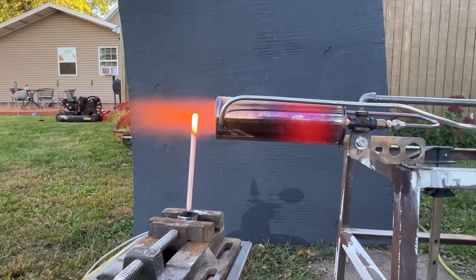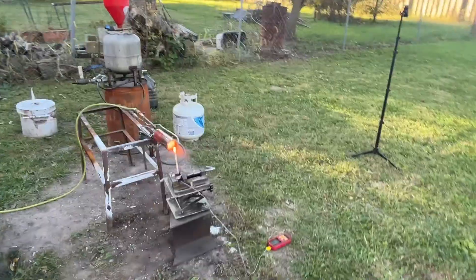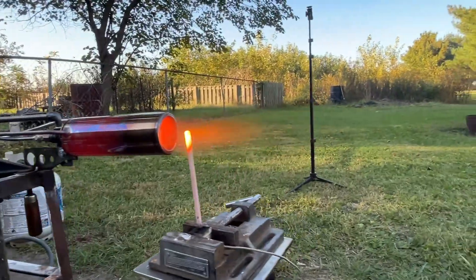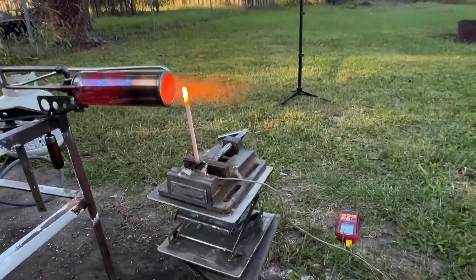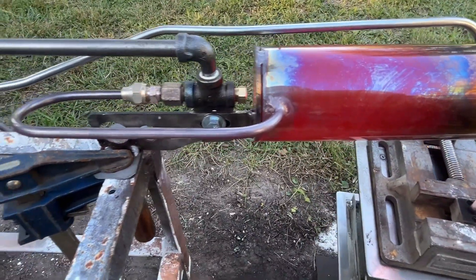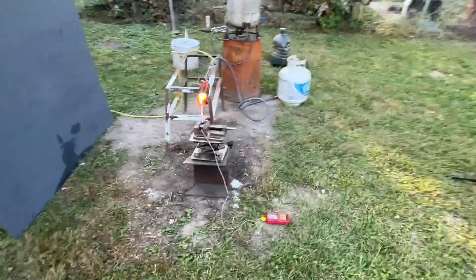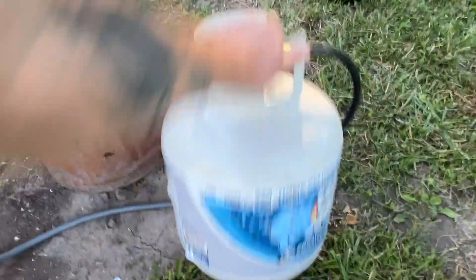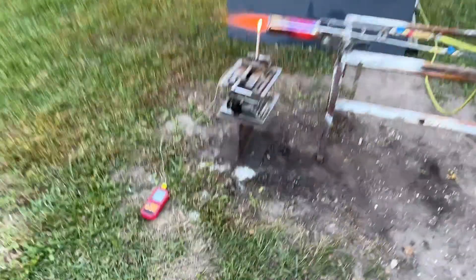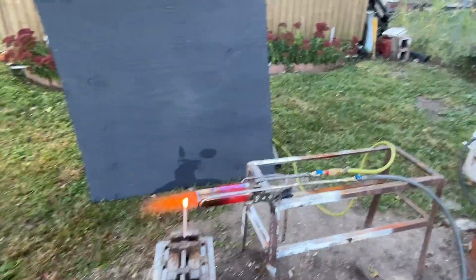I feel like with the right setup, this foundry burner could get a furnace up to 3,000 degrees Fahrenheit without oxygen. I feel like we could melt the higher-temp steels and metals — titanium, all that — with this thing set up right. We're going to have to go with liquid propane though; the bottle just ain't going to do it. We're losing pressure and temperature as we lose bottle pressure, but we're still above the old personal record, which is phenomenal.